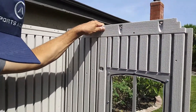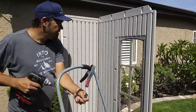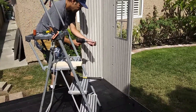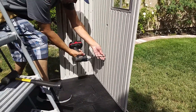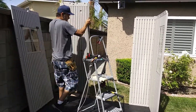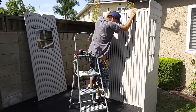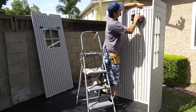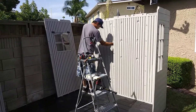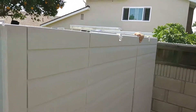You can see the nice straight line across the top right there where the screws point. Put your first screw right there in the pre-drill holes — should be five of those going down that spline of the wall panel there. A ladder is a nice, perfect trusted tool for these assemblies on all the sheds. So you put the five screws in and your first and second panel are connected. On to the right side wall — drop in a straight panel and just kick it over a little bit to the right. Couple of kicks, and sometimes use that little wood block and a little mallet at the very bottom on the left of that panel and give it a couple of taps. Then put those screws in, zip zip, and on to your next panel. Should be two panels on the right before you get to your rear corner. Make sure that one's in correctly the same way: drop it in, kick it over to the right a little bit, and give it a couple of taps at the bottom edge if needed.